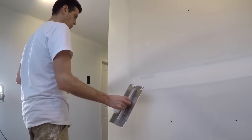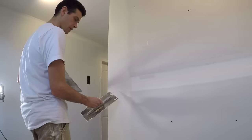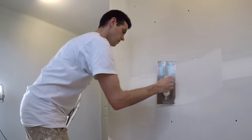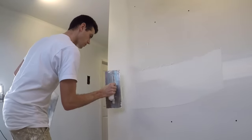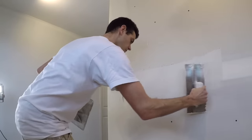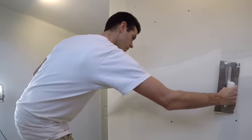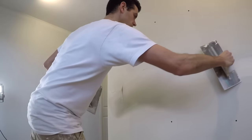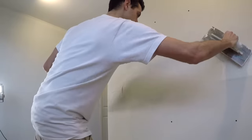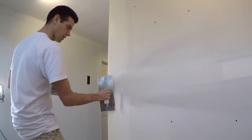What about this flat now? I'm not just going to wait for this corner bead to dry before I coat this flat. How I like to do these — I like to do the corner beads first. You can see I've left my lift-off right here, and I like to work into the corner bead and stop right about there. So I've gone into the corner bead about two inches. I'm now going to feather my edge and sort of swoop down like that while lifting my trowel up so as not to dig into here.